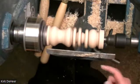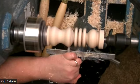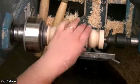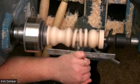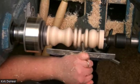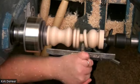This is why we needed to keep the tailstock right here — we want the support as we're cleaning up the spindle inside. We're going to roll the bead from the top of that bead all the way in. You can hear those captive rings just shivering! Lots of people tape them to the side — I live dangerously and just reach between them. Yes, I have broken rings this way. Wood grows on trees, it's okay. We're just going to clean up that spindle, eyeballing to make it look even. If it looks good to you, it's good.